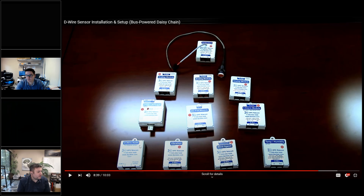From the bottom left here, there's a propane sensor. This is designed to just intercept from one of those Rochester-type Hall effect sensors. It picks it up right here, digitizes it, and then sends it out across a D-wire back to the main. It's essentially just an analog input on a digital D-wire node.